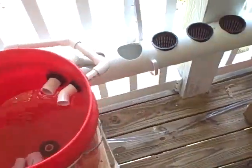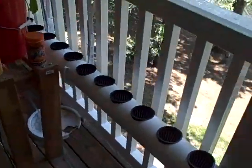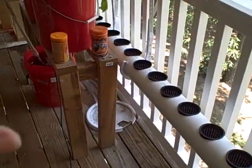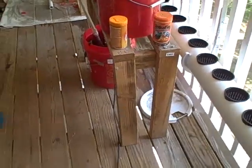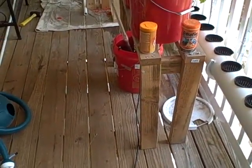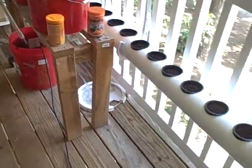That's the basic idea — a few technical challenges remaining, but it shouldn't be too difficult. Any time you have a small system like this — and this is a 55-gallon drum, so definitely a small system — you're always going to be dealing with small pipe sizes causing a lot of pressure for the volume you want to pump through them. Siphons a lot of times won't work with small pipes or small tubing because of that friction.